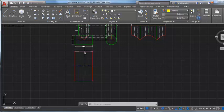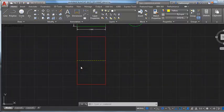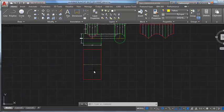And the outside or the ends of my pattern here would kind of represent this line in this front view. It'd kind of be that 6 o'clock position here, like 180 degrees from the branch. That's going to be kind of where my header seam is. And like I said, it could be anywhere, but I'm just going to show you that. It's going to put my branch cut out kind of like dead center of this pattern here. So what we need to do this is we need some information from both of these views.